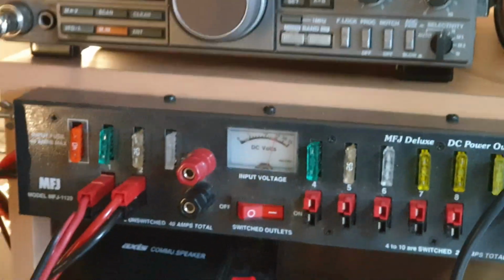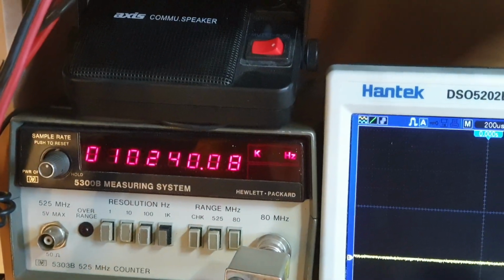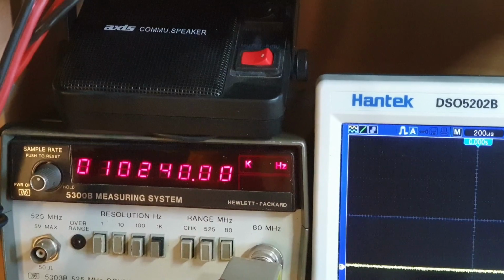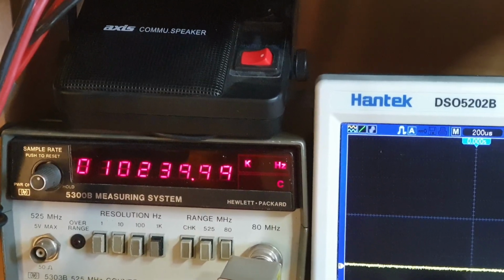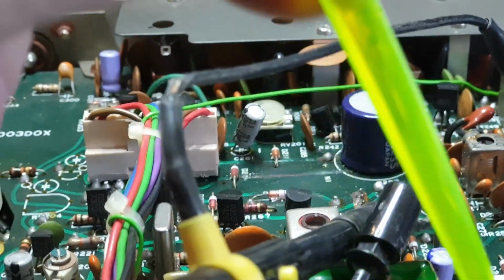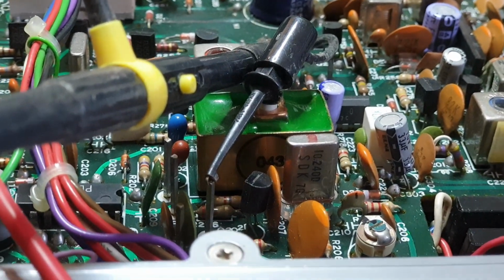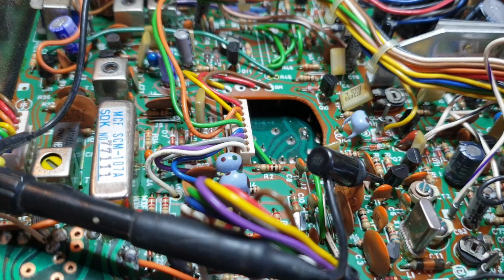We're just setting our 10.240 just to make sure that when people have gone in adjusting things, sometimes it does pay to just go in and set all these things back to exactly where they should be. To be very fair, this would not have been causing any sort of issues, but the front oscillator, the 10.240, needs to be 10.240, dictating all your channel spacing, etc. And generally that's not too hard to set. So let's have a look what else is going on.